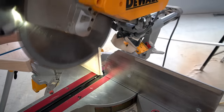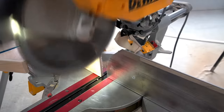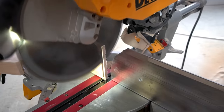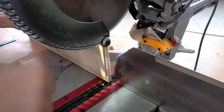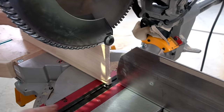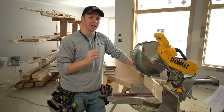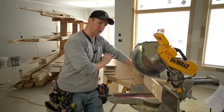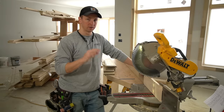To cut it vertically, you're going to need a couple of things. One is the capacity to do so. I just did a video on why I love the Dewalt DWS 780 miter saw, which is a 12-inch slider. One of those reasons is I have enough height capacity to cut baseboard in the vertical position. One of the key advantages to cutting baseboard vertically is that you get a longer frame of reference if you set up your miter saw station correctly.